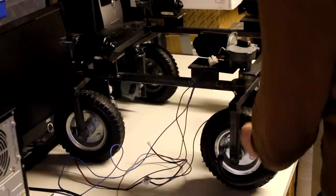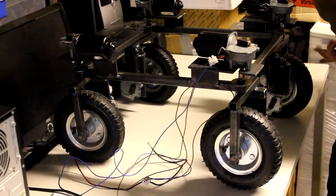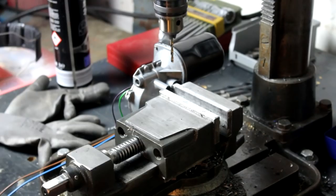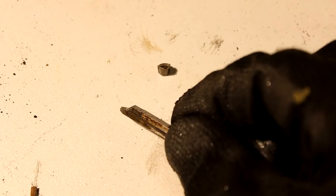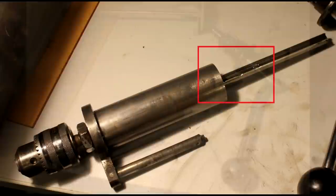So how will it go on? Well, I would be happy to tell you that the next video will be about the robot again and that there will be quick progress, but there are too many things to take care of. For one, the drill press broke during really the last strokes for this project. I've drilled hundreds of holes. And while drilling like the last three or four holes, the drill press died. A key inside the machine broke, but it also damaged the keyway that it slides through, typically. And that part of the machine is now just damaged. It's maybe just scratches inside, but it might be bent. At this moment, I don't know if I can repair the drill press. It seems to be a bigger problem.